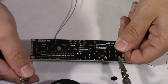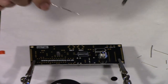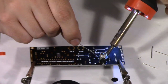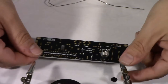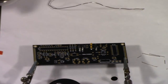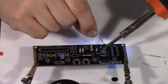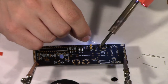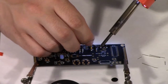J1 is on the other side of the board. I'm going to heat it up just a little bit — just enough to tack it so I can flip it. Now I'm going to fully solder this. For a power connection like this you want to get it nice and hot so that solder flows through the whole thing.